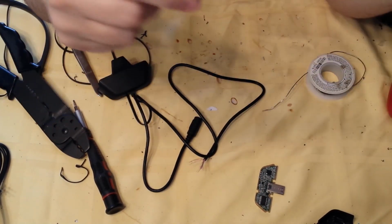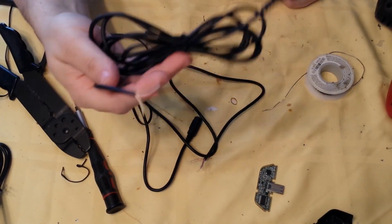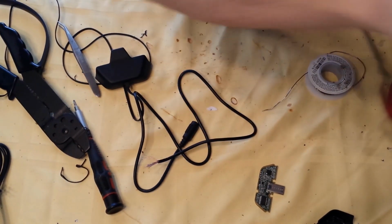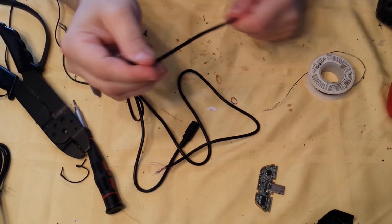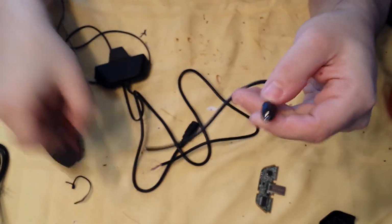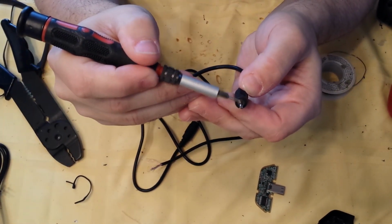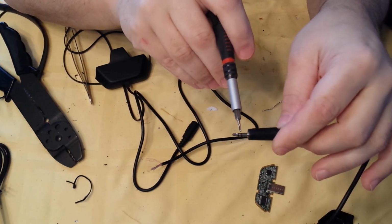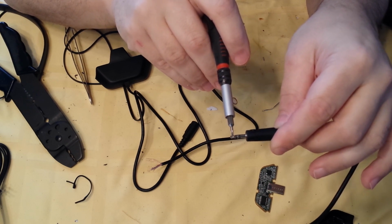If you use a different cable, for example, here's just another different company's cable, you'll see that the ends are a little different. And I don't know which one's which out of those 3. Now, I can tell you on the male post, this long end here, before the 2 rings, that's your ground. Your middle is usually your microphone, and your top is usually your headphone.